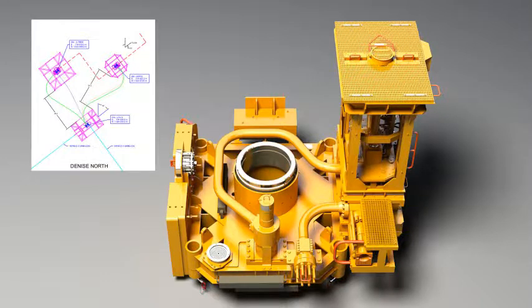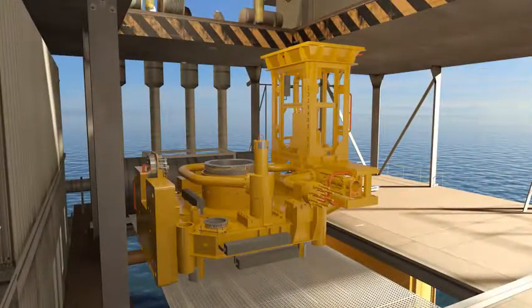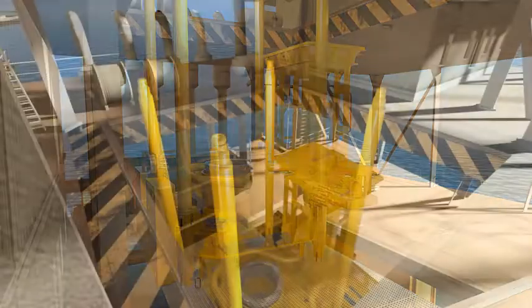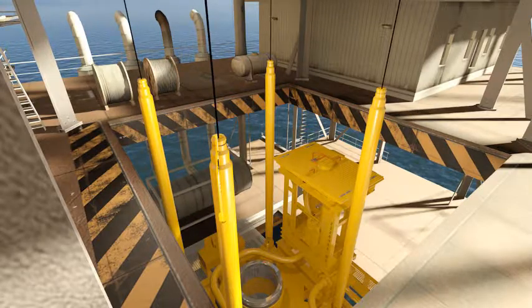As the flow base centering and the flow base running tool are GE designed equipment, the GE operating procedure should be followed in the setup and running phases. Guide posts, used for guiding the tree connections onto the wellhead and flow line, are installed into each corner of the flow base, and pins are inserted to lock them in position. Guide wires are connected to each post using guide wire anchors that lock into the post tops.